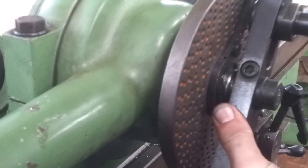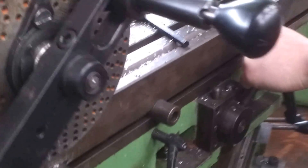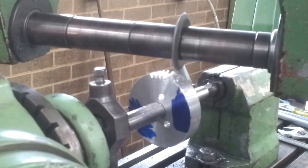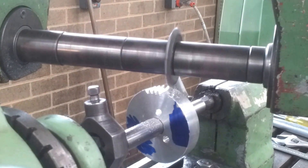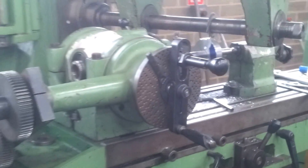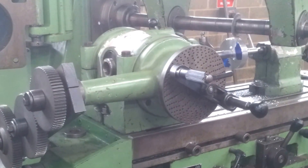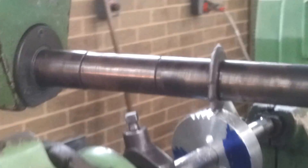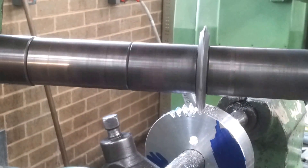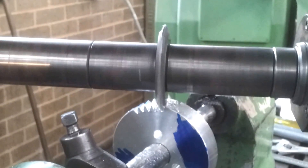44 teeth, so we'll index to the next one. Push that indexer back there because we're not doing one full revolution. We've gone up our full turn here, and here we're cutting our next tooth. All looking pretty good — of course Byron's going to find out if it's any good when he gets to the last tooth.